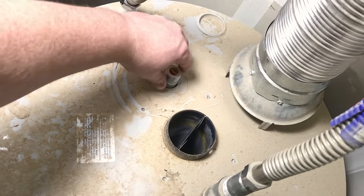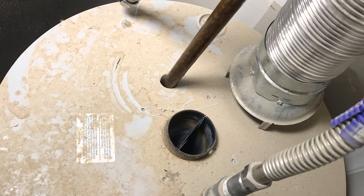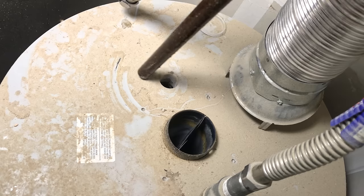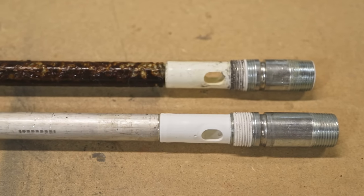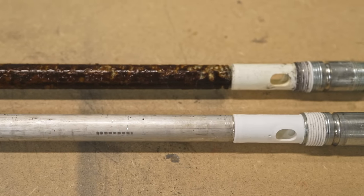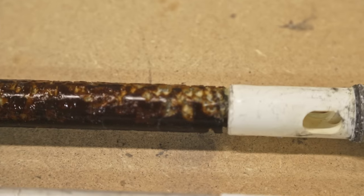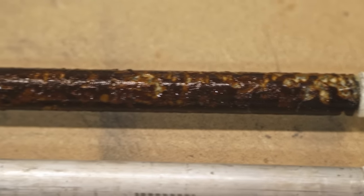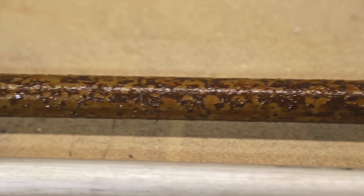Okay, the anode is completely free. Let's lift it out and see how it looks. Now this is not all that corroded, and I barely have enough ceiling space to pull it out. If you didn't have enough ceiling space the only way to really get these out is to cut them with a hacksaw as you pull them out. Taking a closer look, while it is beginning to corrode it's really not that bad — a little pitted and discolored, but there is quite a bit of life left on this particular anode. If you pull yours out and it looks like this, you're actually good to just put it right back in the tank. You've probably got at least another couple of years of life on that.